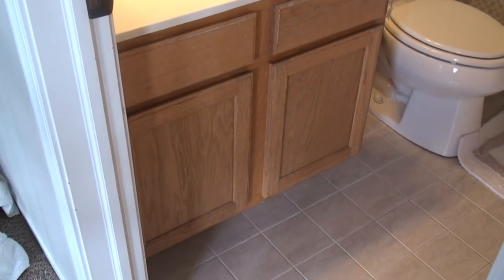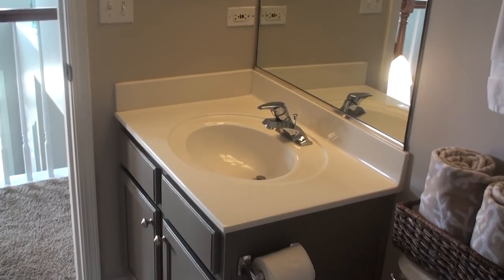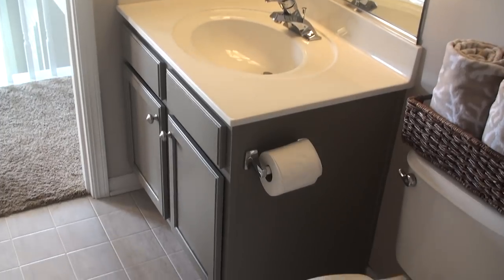Another project completed! Here's the before, just to remind you what it looked like, and here is the after. I'm so excited that I finally painted a cabinet with Annie Sloan chalk paint. The cabinet turned out really beautiful — I'm happy with the finish and how the top coat holds up. One final note: if you're painting with white, this top coat will yellow your finish slightly, so test it on a small spot before committing to a whole cabinet. Thanks for watching!